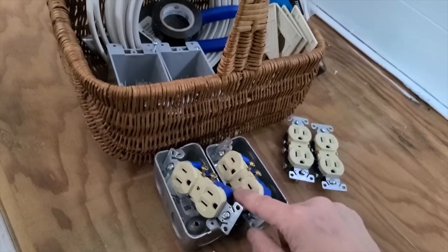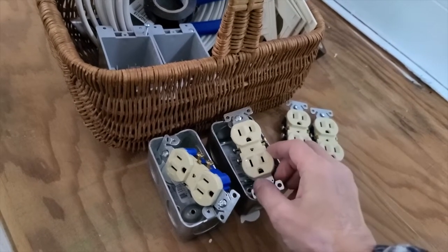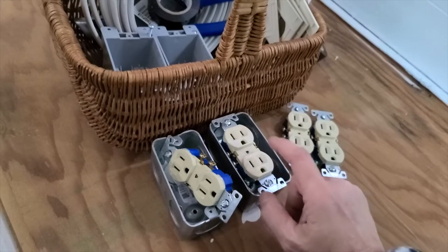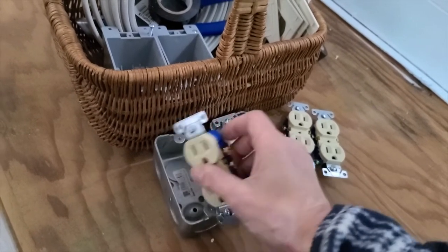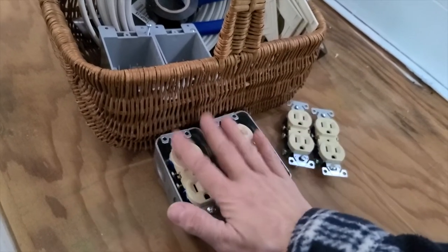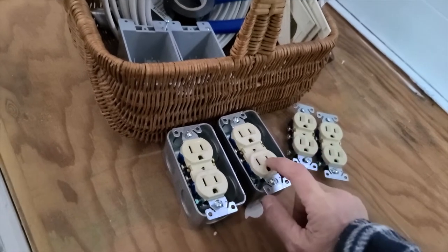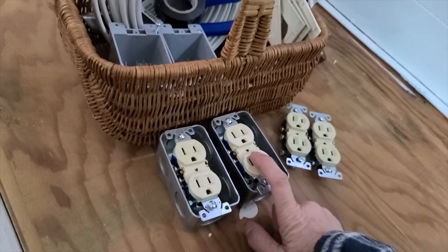And then there'll be a secondary plug in there for whatever I need. And the other one will be there so that when I start implementing a battery system in here, I will have a place for a converter to plug into. It's usually really good to have something like that near the breaker box. So that's why I have two of them, so that they'll each have a purpose. The one for the converter box will probably also have a plug that goes along to a charging station.